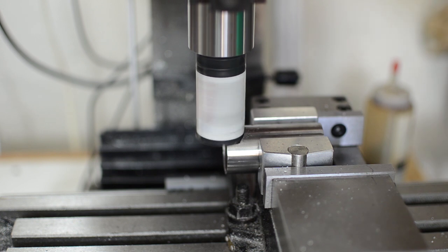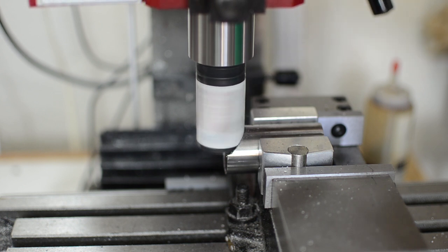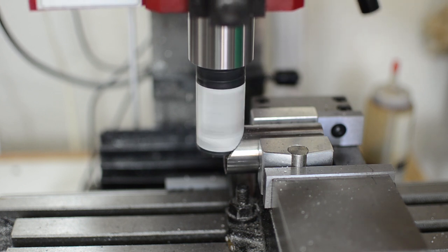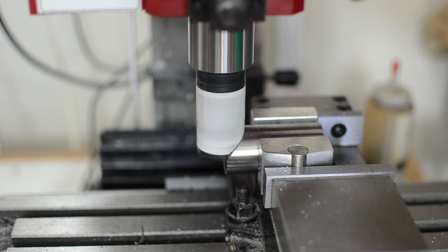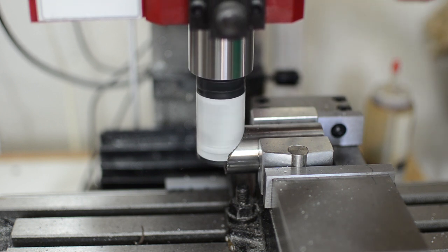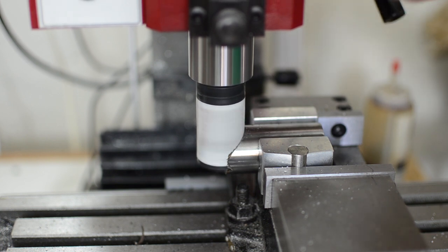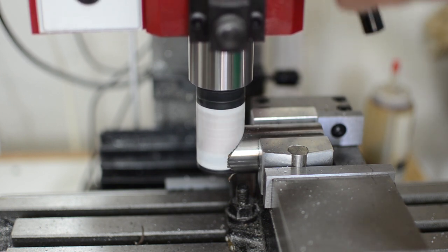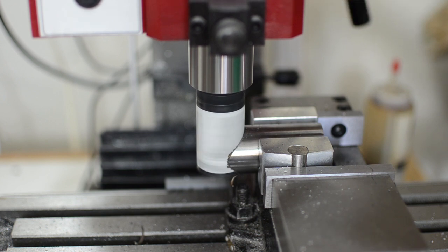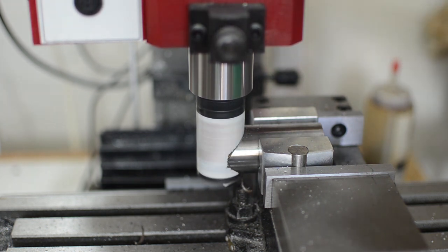Here I am using a hole saw to make a miter cut — it's in my mill, actually. I don't usually use the mill, but I started using it because it's a lot more convenient. As long as you use an arbor on your hole saw and snug it right up in there, it's solid — much better than the lathe. You can also see I'm using Joe's angle blocks, which are super convenient.